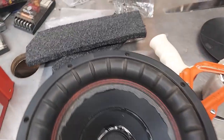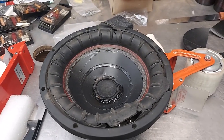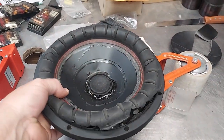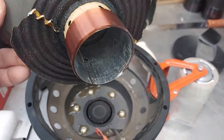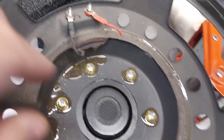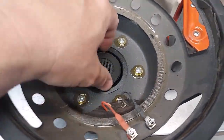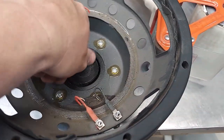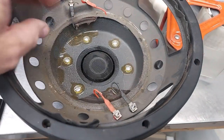This is one of the last rebrand woofers I did before the move, which was in 2014, so it's almost 10 years old. You can see somebody bottomed it out — it's rubbing, copper coil, which is nice. I see a little bit of age there, but that's just age. It uses a nice little 2-inch coil. I'll pull that screen out and grind it — make sure you tape off the gap when you grind because this is steel and you don't want steel getting in there. It's like a 10-32.